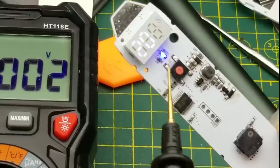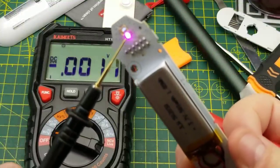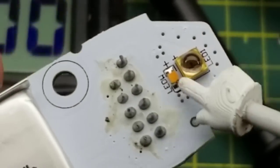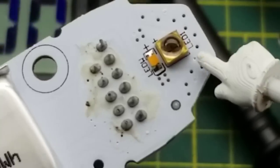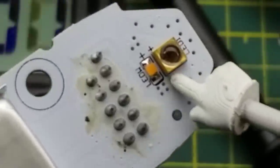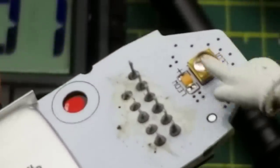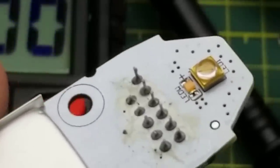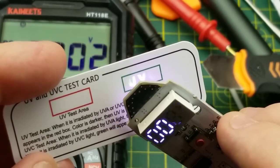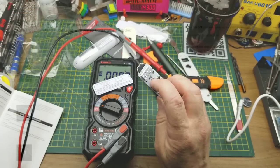There's an active little LED blinker there. I'm going to show this to the camera but keep my eyes out of the way. There is a visible light LED there, and there is our ultraviolet LED. Unlike normal LEDs in this kind of — what is that — a 30-30 package, this one actually has some metallization around it, which I'm assuming is more heat spreading. It probably has a special kind of resin on it that's more UV transparent. But as we saw, it definitely lights up the UVC-sensitive ink on my little test card here. That really surprises me, especially for something I found so cheap in the dollar store.